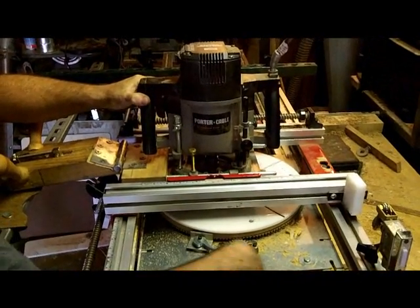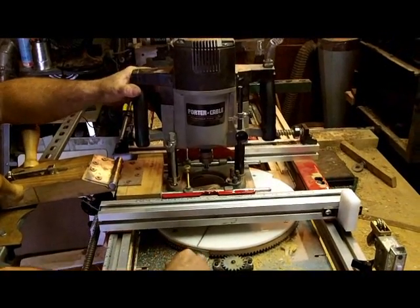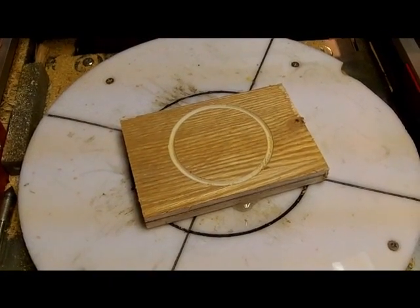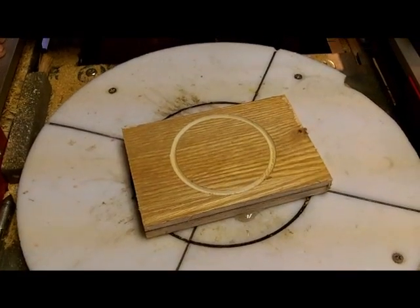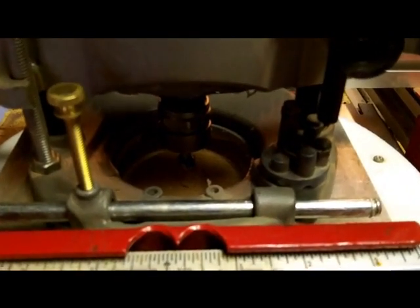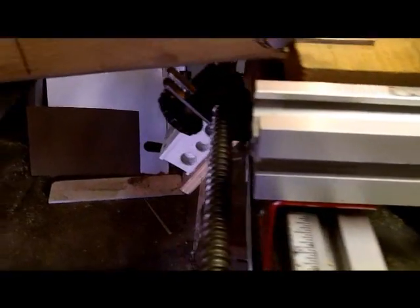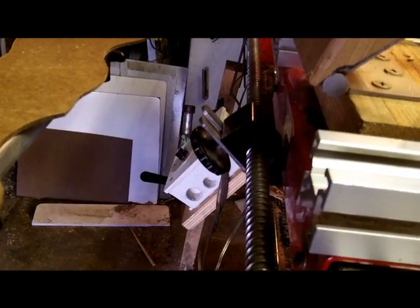We're going to start out with a round circle to give us something to template follow away from. That's what we accomplished with the first cut — basic rotary table technique, just creating a nice circle. Then we're going to use a template follower to create some little fly-outs from the circle itself. The Y-axis template follower is ready to follow the template. We've got the rotary table locked with Kurt's new cam lock, and we're also locked onto the threaded piece — the drive screw — so we're ready to engage and go.